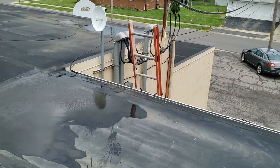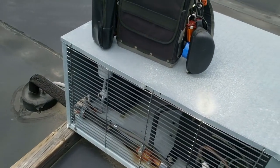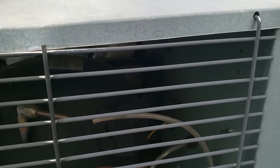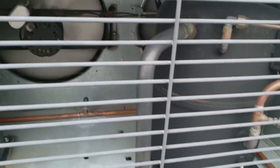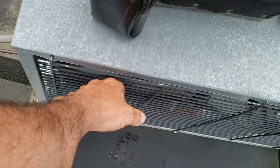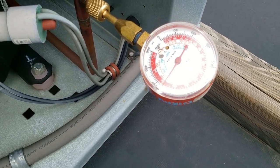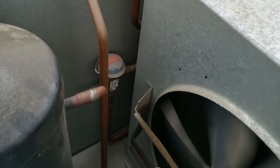Making sure you guys are strapping your ladder. We get up here and it's not running. First thing I see is a high-pressure switch — can't help but wonder if we've tripped out the high-pressure switch. And look at that — the fans are running. I can feel some massive heat coming out of there. We're running about 380 pounds head pressure, and there's a head pressure control there.